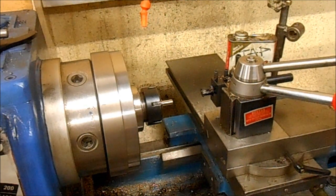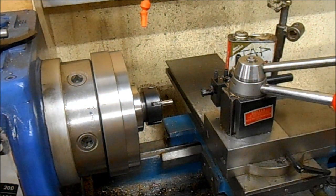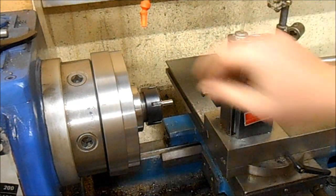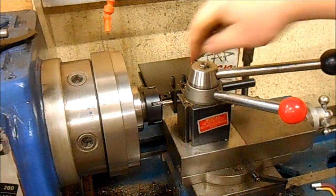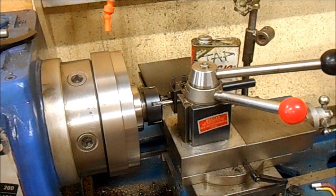Here's my setup. I've got my piece and collet chuck. I'm using an internal threading bar and I've got that set out from the tool post only a very short distance, as it is being used as my stop. I can bring the side of the tool holder up to the end of the bar and that gives me my distance.